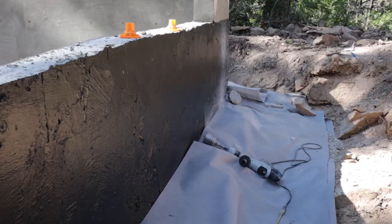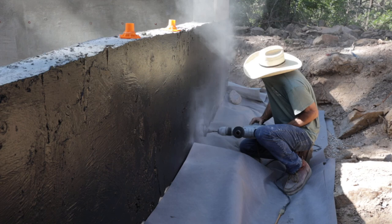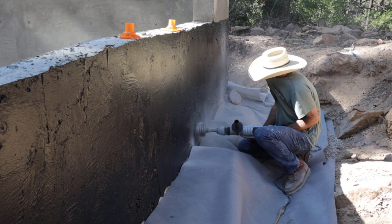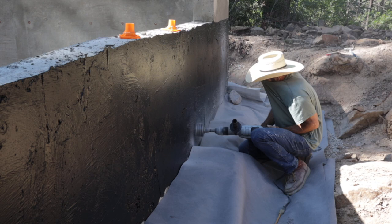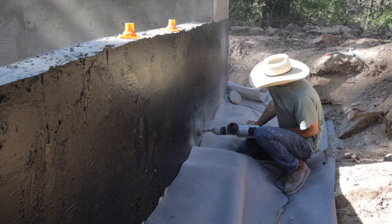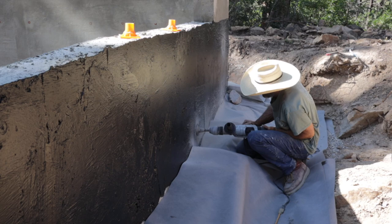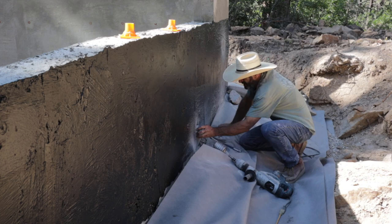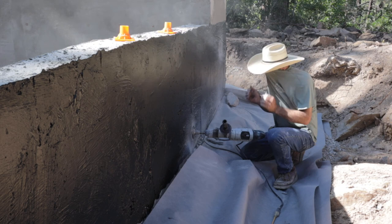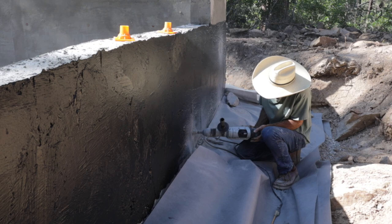Yeah, I let it rest for a little while and then I started to drill this other hole. Now this hole is going to be for the water service. And I'm actually sleeving this water service in a Schedule 40 PVC pipe. The reason being is I'm about 4 feet deep right here, and I want to make sure that it doesn't have any frost problems. So I basically sleeve this section. Usually where I'm at, 4 or 5 feet is the recommended depth to keep your water from freezing up. And if you put it in a sleeve, then you get some added depth out of it. Now when I put these sleeves in, I'm going to use a product called water plug that we use on septic tanks and stuff, and I'm going to seal around it on both sides before I backfill.